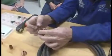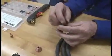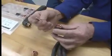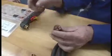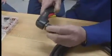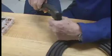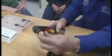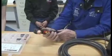Now we're going to assemble the torch. This is the retaining cup. We put the nozzle down inside — it has small holes where air pressure comes out. Next we put in the swirl ring, which helps direct the airflow. Then the electrode goes in at the top — current comes through the center and air goes around the outside. We screw it to the torch, making sure it's tight and grounded. Then we put the cap on and we're ready to go. The yellow safety trigger prevents the torch from firing accidentally when set down — if it's broken off, touching the trigger could automatically start the arc and cause serious damage.